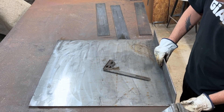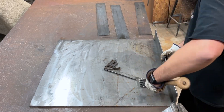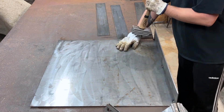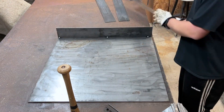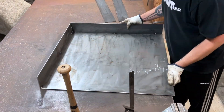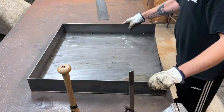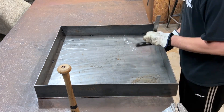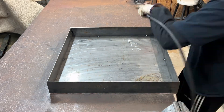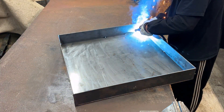To start out I am using a 30 by 30 inch quarter-inch plate for the base of my burn table. I actually bought that plate to cut different things out of, but since I don't have a nice way to cut things, it's now going to be used for the base. The walls are 3/16ths by 4 inch flat stock. I'm trying to keep them square, and I'm going to weld the entire inside solid because I want to have water in my burn table, so it can't have it leaking.